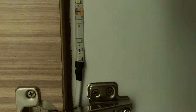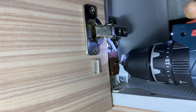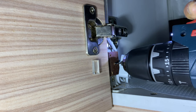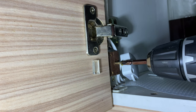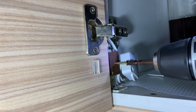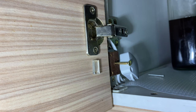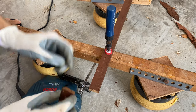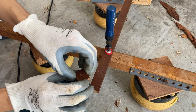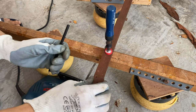Next would be the switch — I need to install it underneath, but before that I must install a spacer and mount it onto the cabinet. It breaks! I need to show you how to make a spacer because I used a piece of hard wood and I believe my pilot hole was too small. It's supposed to be 1mm smaller than the screw size.